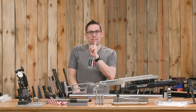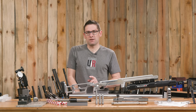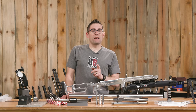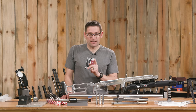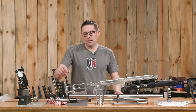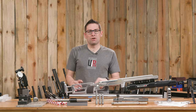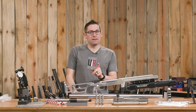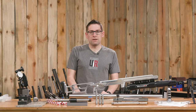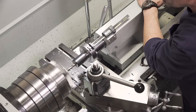One note: this is going to be specific to your machine. Once you machine it in place, it's perfectly aligned to your lathe. You need to align your lathe before you cut the tooling. The cutting process is really simple. You're going to start by putting the Morse taper blank in your tailstock, get your tailstock up into position, put a drill bit in the chuck in the headstock, get the appropriate speed going, and feed the tailstock in to do your pre-drill.